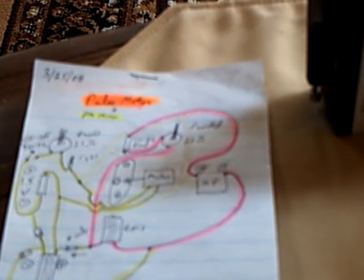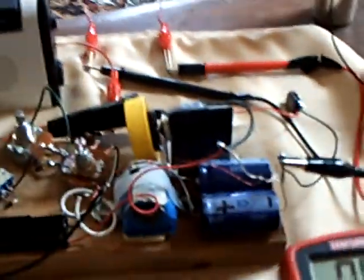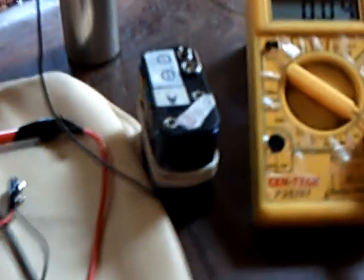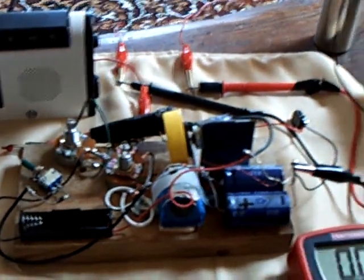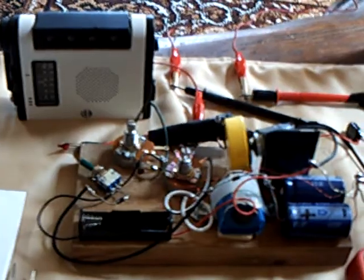It's just a normal pulse motor circuit with some 25-ohm rheostats to vary the voltages, and then some diodes and capacitors and stuff here and there. The project was to use that solar panel right over there during the day to gather enough energy to charge that nickel metal hydride bank and that little battery there. Then during the night, let the thing run on the stored energy, and during the daylight, recover enough energy off that little 135 milliamp panel to make this thing run non-stop, day after day, as long as we had sunshine — which here in California is not a problem.